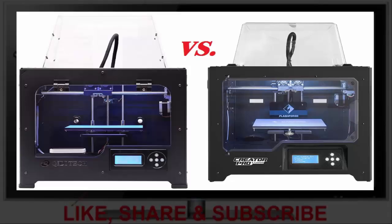Although the main boards are quite similar, both being variations of the mighty board architecture, the FlashForge uses an ATMEGA 2560 while the QIDI uses the 1280. There is no performance difference in the chips — the 2560 is simply a larger flash size which, while a nice feature, does not actually have any advantage over the 1280 at the moment.